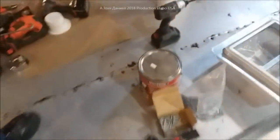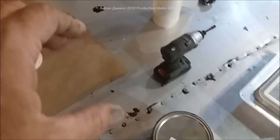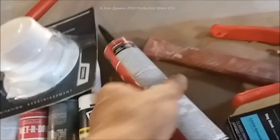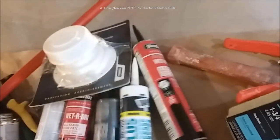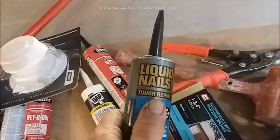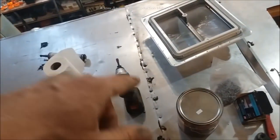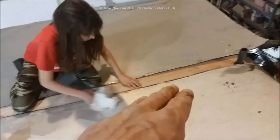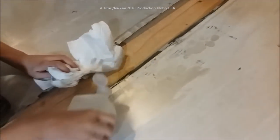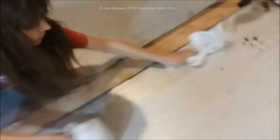What we're doing up here is we're using the Gardner sealant - it works unbelievably well on mobile home roofs, travel trailers and stuff. Using the wet or dry, you can get it at Home Depot or Walmart. I get it a lot cheaper ordering at Walmart. They also carry it in the gallon bucket, which is just as good. These are rubberized adhesive sealants that work on all kinds of metal. Kira Marie is using alcohol to prep the edges - just pouring it on and taking paper towels to get the oxidation off so the sealant sticks really well.